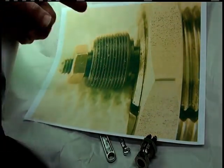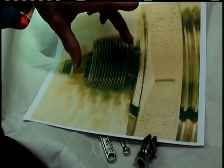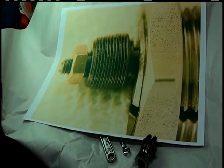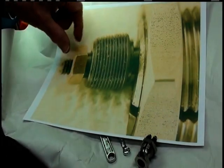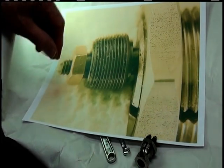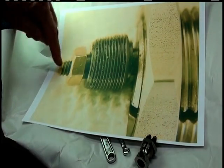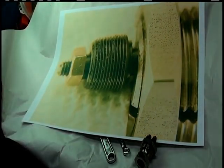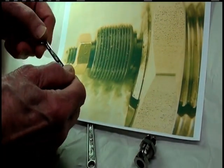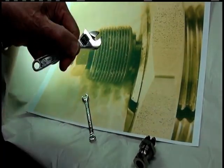Now, just rolling this straight on a spoke would not create threads. How they do it is they angle the pins. So that angle is the angle that's determined on the spoke itself. So if you're going to repair an old one, the pins must be firm in there, so when you take them out you'll have good holes, and make sure you put this back with this on the back side and the smaller end out on the front where the nut is. I mentioned the size of the nut is 5.5 millimeters. You can use a wrench like this, or if you got a little adjustable wrench, that'll do the job too.